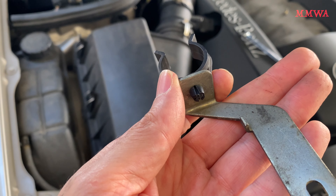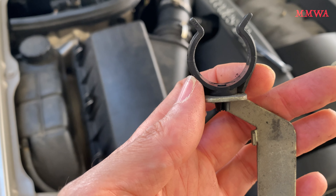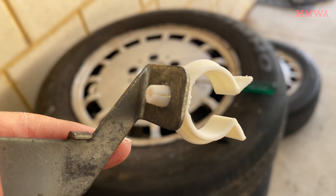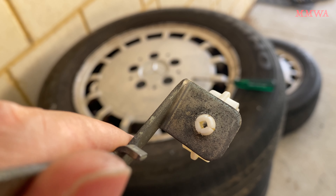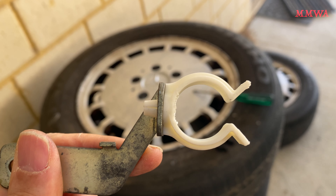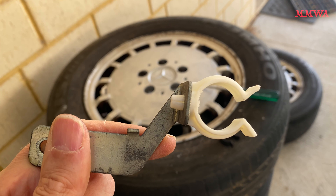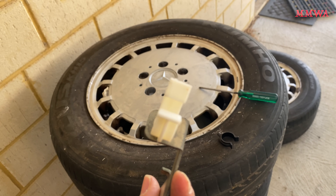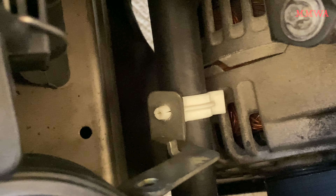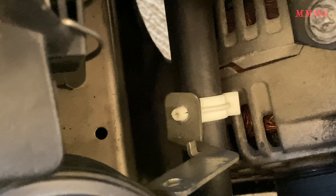The hole is actually 7mm that it needs to go into, and as you can see this is a little bit too tight — it's actually deforming those prongs a little bit too much, so I have completely redesigned that. We'll see how that goes on revision two. Out of interest, the hose clamp part is absolutely perfect.